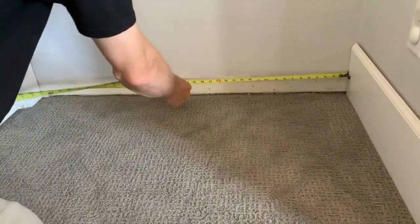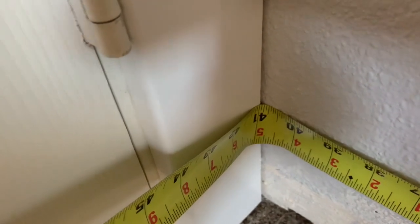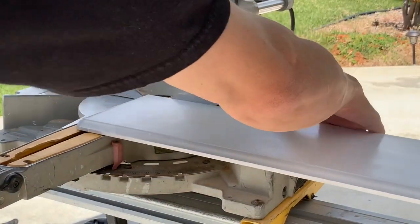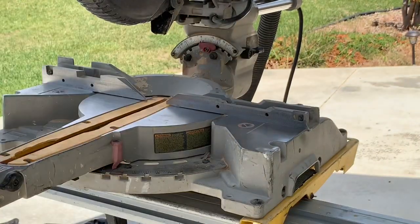Leave this piece up against the wall, put your tape measure against it, and run it to the other side. You're going to want to add an eighth of an inch to this measurement — so this one I would do 41. Take those pieces to the saw, make the zero cuts on the marks you made against the outside corners, and cut those to length.